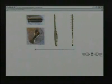So these pin tips actually ride in and rotate and spin on their axis as they're tracking up and down as the key goes in. And only if the pins have tracked to the right height and rotated the right way can the top shear line clear, a sidebar fall inward, and the whole lock operate.